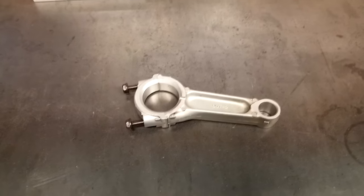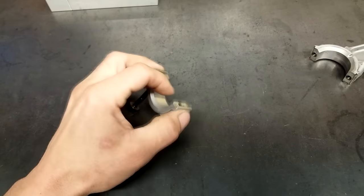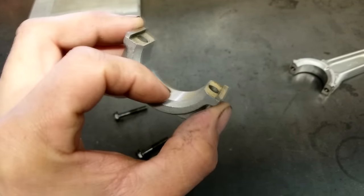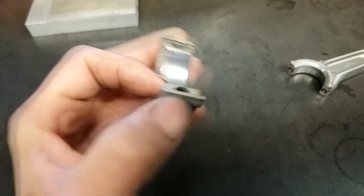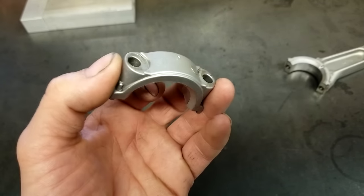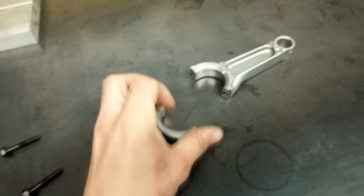Preparing the caps — I need to drill the hole and do all of the machining I won't be able to do when the bolt head is in place. I start by facing and drilling one end as well as making these notches to lock the rod in place as per my customer's request. I also need to clear the bolt head diameter on the other side. I finish the cap preparation by doing the hand shape, held with light pressure and taking small safe cuts.